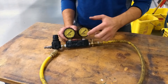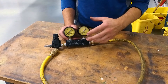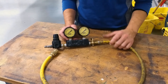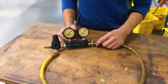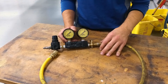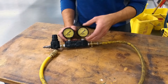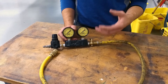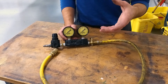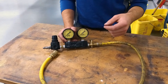The other thing I wanted to discuss was the differential pressure readings themselves and what that can mean for you as the pilot or owner of the aircraft. Understanding what these mean can help you determine the health of your engine and understand its potential longevity. So if you've got low compression — say 60 at 80, 50 at 80, something abnormally low — depending on whether it's Continental or Lycoming and what's acceptable for that engine, the main thing to look for is where the leak is coming from. The mechanic is going to check for a number of indicators. The first thing is if air is blowing by the rings — you're going to hear the air and can actually feel it coming out of the breather tube of the engine, which indicates the rings might be an issue.